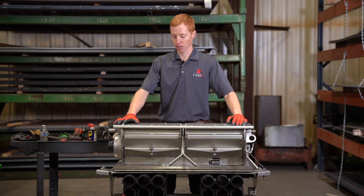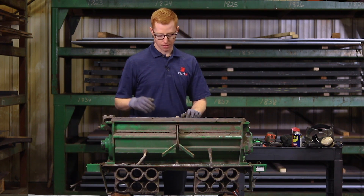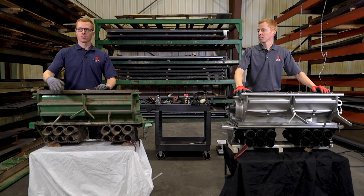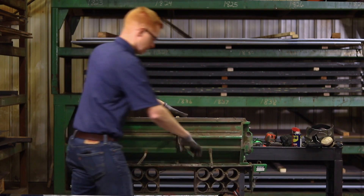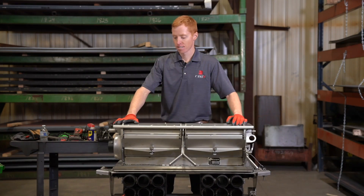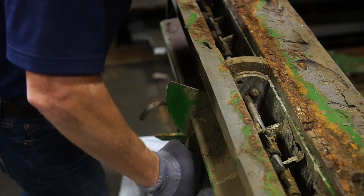All right Jesse, what else do we have inside of here? Now we're on to the meter housing itself, and inside here are half-width disconnects or shutoffs, which are vital in order to turn off the flow to the meter roller itself and to divert product into the clean-out area. Now this is where the shutoff is, but unfortunately this one I'm having twisting problems getting open and closed. This one seems to still work okay, but I can't seem to get this one fully closed or open.